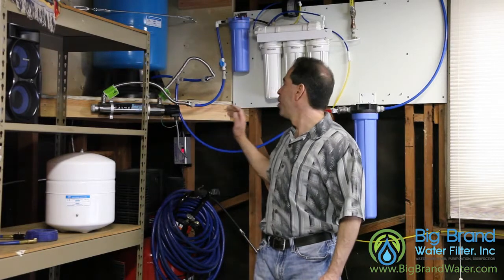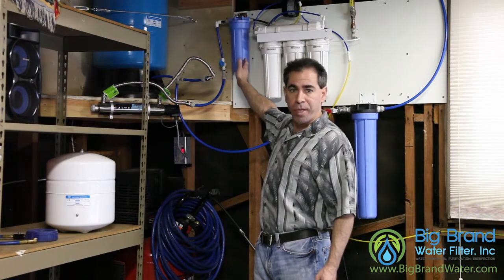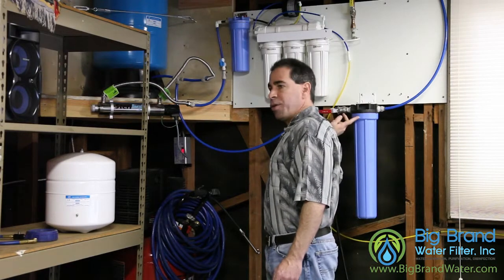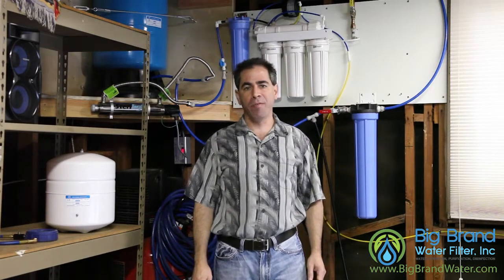I have a 20-gallon tank up on the shelf. The water goes in and out through the 3/4-inch connection. When it comes out of the reverse osmosis, we do a remineralization filter to correct the pH and add back some calcium and magnesium. Then we go through a UV system and into the tank. On the way out of the tank, in half-inch tubing, it goes through here to our carbon polishing filter — a 20-inch instead of a 10-inch filter. Then up the wall into pharmaceutical-grade 316 medical stainless tubing into the kitchen. Once it gets in the kitchen, it tees off below the floor: one line goes behind the refrigerator for ice cubes and cold drinking water, another goes under the sink where I have a cold faucet and a faucet with an ozone system to disinfect, and also up behind the stove to the pot filler so I can fill pots of water to cook with.